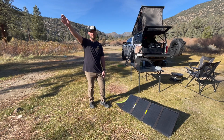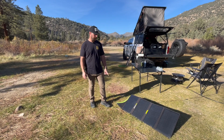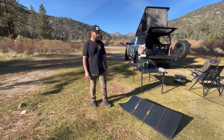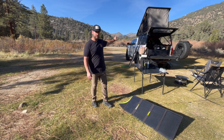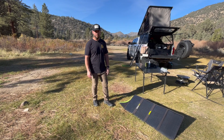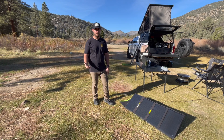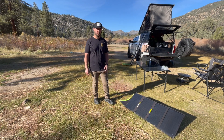For days like today, the sun is over here and my panels are facing the opposite direction. So I have these portable panels — these are the 50-watt Nomad 50s from Goal Zero. They're super lightweight, super modular, you can take them out and move them around. I have about a 30-foot extension cord. When my main panels aren't getting enough power, I use these and I get anywhere from 40 to 45 watts out of a 50-watt panel. For those of you that know solar efficiency, normally you can only count on around 80%, so 40 to 45 watts is really good and these consistently provide that.